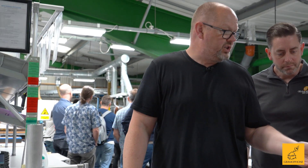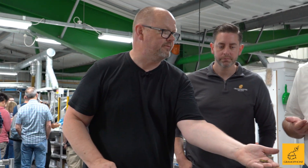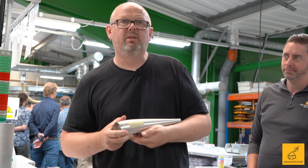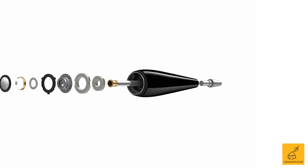I pre-broke this one, so don't worry. If you look at the bottom of it, you can see it clearly looks like carbon — but chemically it actually is diamond. We're aware that somebody who didn't know would look at it and say that looks like carbon. So to help that illusion, it gets a uniform outer coating of platinum, which just goes over the top. The only reason for that is otherwise it looks like carbon. The second part of how we mount it into the system is the tube loading system — that's the tweeter assembly on top.